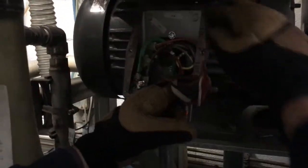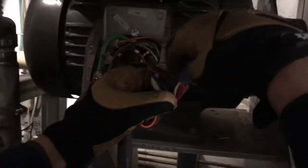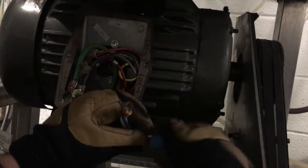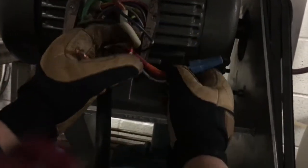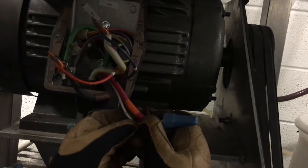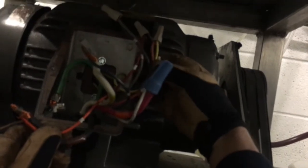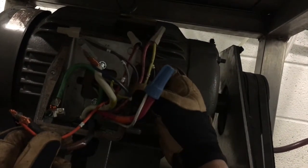And your yellow — which was going to be white to yellow, or 1. So let's go look at that real quick. I hope this doesn't kick on. Sorry guys, I can't control them turning everything off if it kicks on. But bottom line right here, the wire caps — we're just going to use blues because they're only running 20 amps, so it's not a big deal. And then as we tighten all these up here, you'll see that this is 2 — I put my own numbers on them. You'll see this is a 1 and this is a 3.